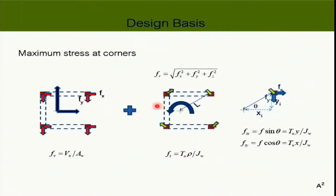And again, when you calculate the moment of inertia for this, it becomes the typical formula, but this time you may want to include the bh cubed over 12 for this piece in the x direction, and you may want to include the bh cubed over 12 for this and this in the y-axis, and then we have the Ad squared term, just like the bolts.